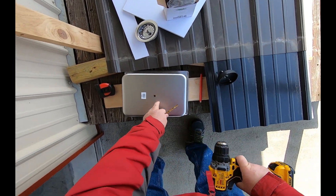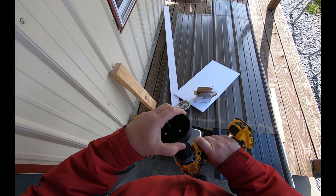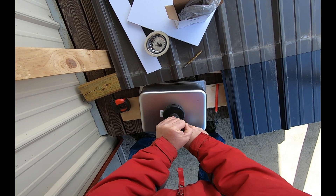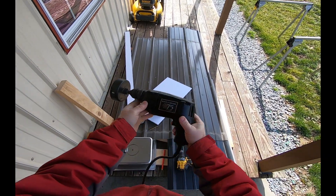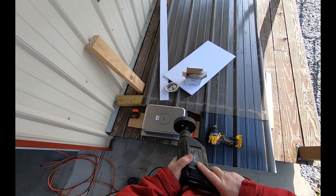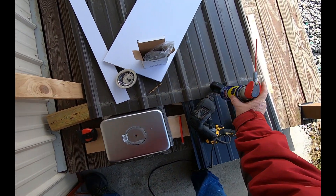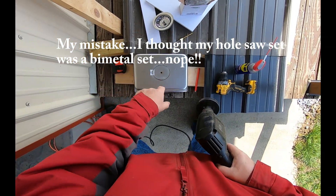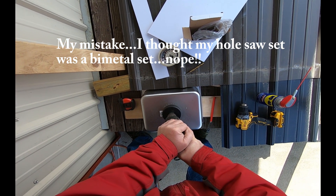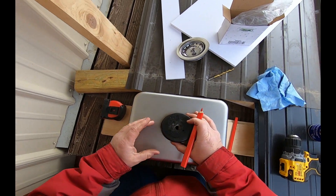It might be thin but it's hard steel. I'm going with my Black and Decker 75th anniversary electric drill. Let me put some WD-40 on there. I thought being the cheaper pan it would drill right through easier, but it isn't. Well, plan A using the hole saw didn't work, so I'm going to go to plan B.